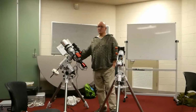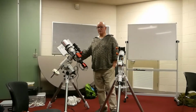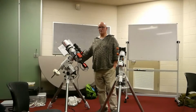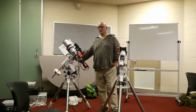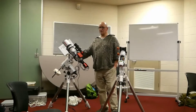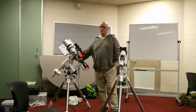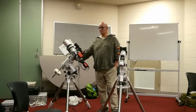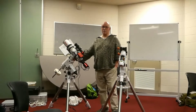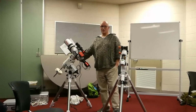But my recommendation is if you've got $2,500, buy a new mount. That's my recommendation, because a lot of them have got belt drives anyway. Yeah, that's right, because they come with belt. The EQ6R Pro has, but that's about $3,000. Yeah, it's got belt drive on both axes. You can always talk about that with the dealer. Sidereal Trading sell these kits. They're called Rowan belt mod kits because Rowan Astronomy in the UK actually manufacture them. Sidereal Trading are the distributor in this country. So you can always talk to them about what would be the best option for you.